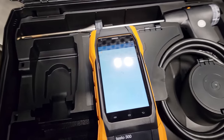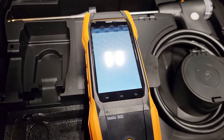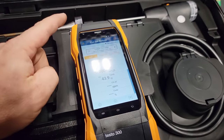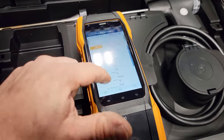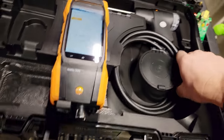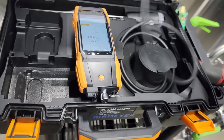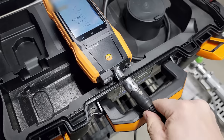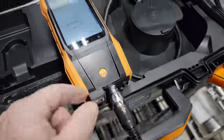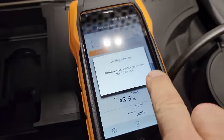The startup on this thing is really quick. There we go — set up for natural gas. Here's all my specs, here's my draft. So when we hit play, which is how you start this thing going, it's going to zero it out. Let's go ahead and plug this in so it's ready to go. Nice, simple connection — you see the two things here? Match them up, shove it in, twist it and lock it. We're going to hit play. It's going to say 'zeroing as needed.' That is your draft — should zero the draft out.